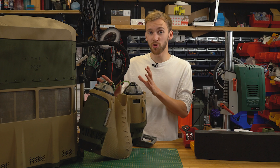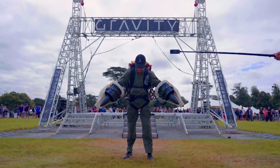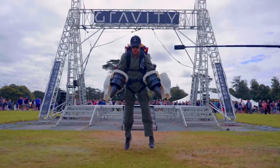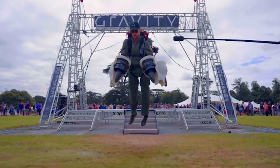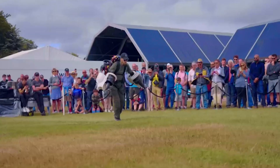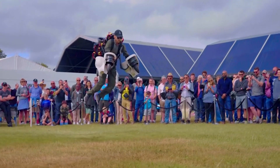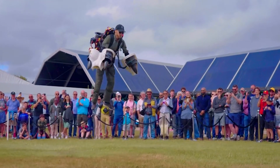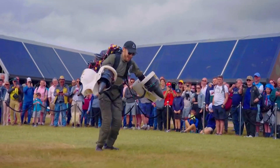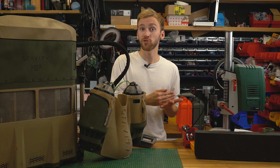We've also built and tested a fully electric jet suit. I was the test pilot mainly because I'm the lightest, and that was key — batteries are just on the edge of allowing a jet suit to work. The normal jet suit runs on fuel, and the energy density of fuel is anywhere between 40 and 100 times more dense than the world's best battery at the moment, depending on how you measure it. For the electric version you're trading off between power density and energy density. We got the electric jet suit to fly for about 30 seconds on the last test, which isn't long at all, but it proves where batteries currently are.